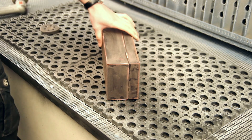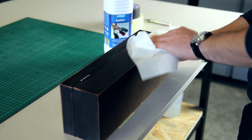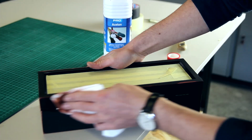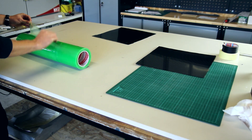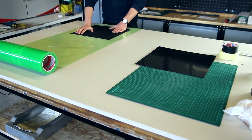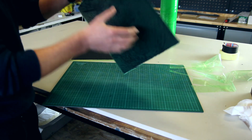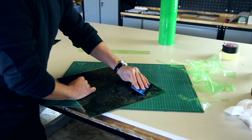The next step is to sand the entire box. Why do we sand it? First, to have a good mechanical bond with the epoxy glue later on. Secondly, you mostly don't know what finish was used on these cheaper boxes — it might just be some wood oil or a 1K primer. Not knowing what it is, you just need to remove any contamination that might interfere with the epoxy and the carbon fiber veneer coming later on.